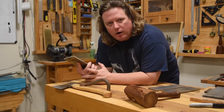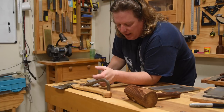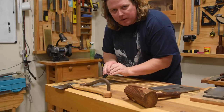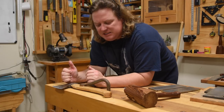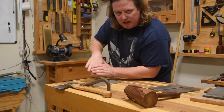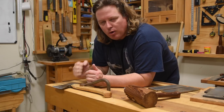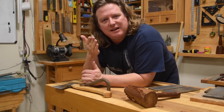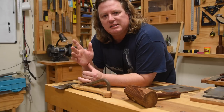There is an adage in woodworking that it's safest to take the tool to the stone, because when you have a blade in your hand, there's no chance that you're going to be going across the sharp end — you're sharpening this way. That's how you do gouges and a lot of handheld tools. But tools like this, I've never found it easy to get the angle right, because you've got two different curves that you're matching up, so you have to kind of flip and rotate. So I've always had better luck putting the axe on the bench and then moving the stone over the blade. But you have to watch out because your hand is moving across the blade, so you've got to be smart. Don't get careless with this technique because it is very easy to cut yourself.